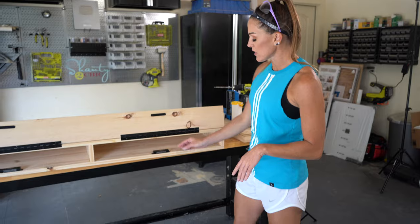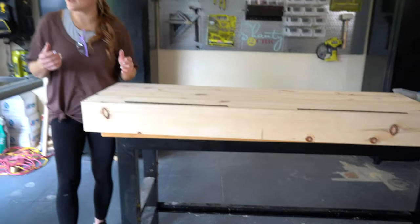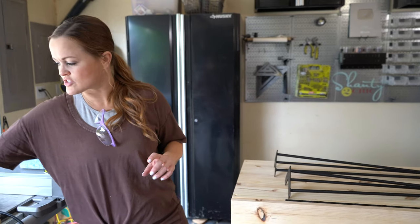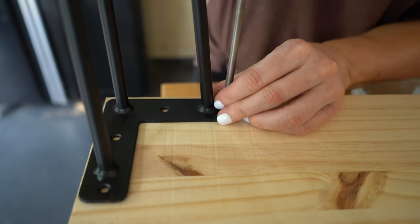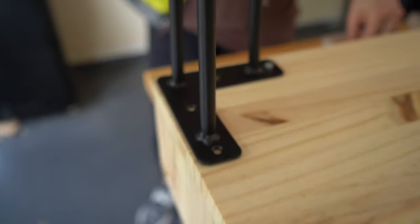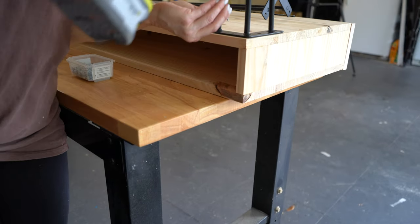We've got all the hardware on — the super heavy-duty magnetic closures and the black hinges. Now we're closing it up and adding the legs. For the legs we're using hairpin legs from Amazon — super easy to attach and really cute. I'll link to them in the description; you can get four for a very inexpensive price, one on each corner. I'm using three-quarter-inch Kreg screws because they're strong and won't poke through. We did leave the back of this open to vent all the video game electronics inside — you won't see it's open, but cords can run through the back with plenty of ventilation.